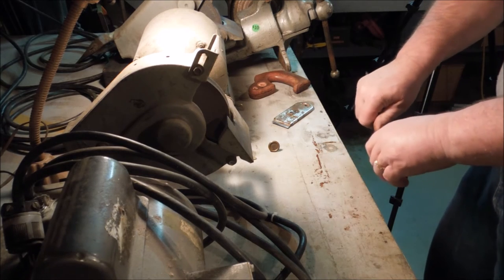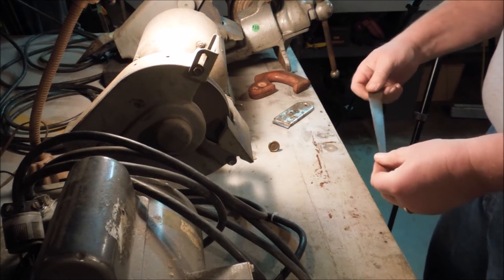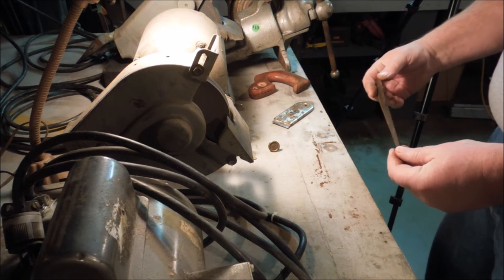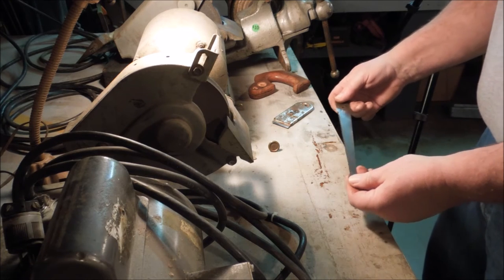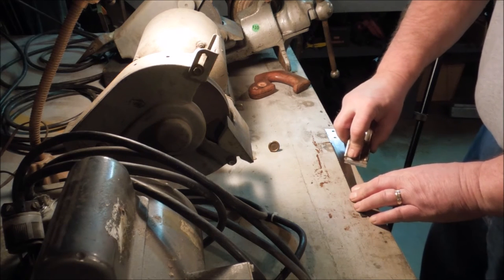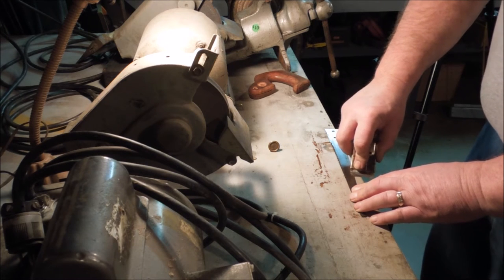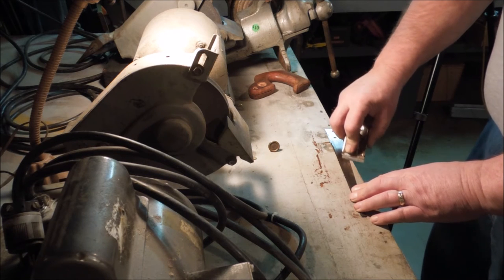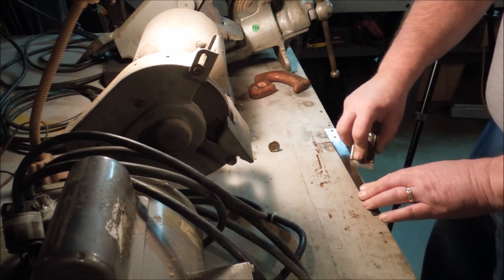Didn't work every time, but once I started doing that, life got easier for the first 90 days anyways. And that 90 days was quite often the time that everything was going to hell. And if I could make 80% of my problem go away by just simply telling somebody up front, you're going to give me three parts, I'm going to pay extra for them. I understand that you're going to be setting up your process, but you're going to give me three parts before I start. And if the supplier said they couldn't do that, then I didn't want them as a supplier.